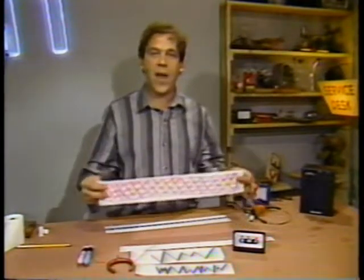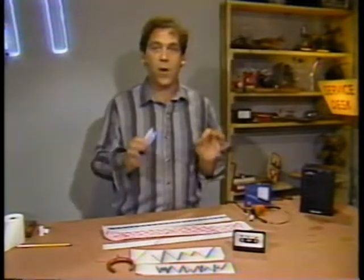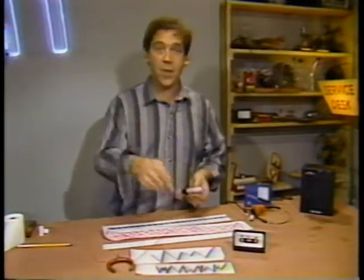My other ill-founded quality concern had to do with the widths of the recorded tracks. The wider the track, the more magnetism there is to make more wiggling current — that means more signal, less noise. Studio machines used a full-width track that was a quarter of an inch wide. The cassette not only used ⅛-inch wide tape, but it put four tracks — each one 1/32 of an inch wide — on that small tape.